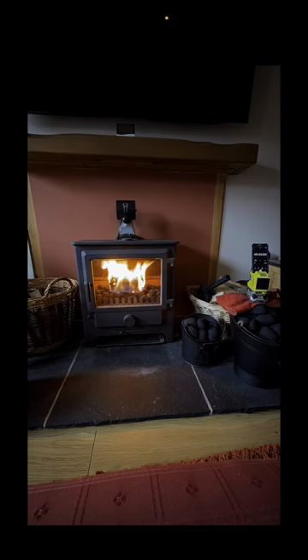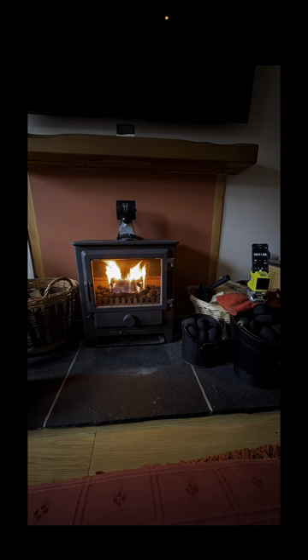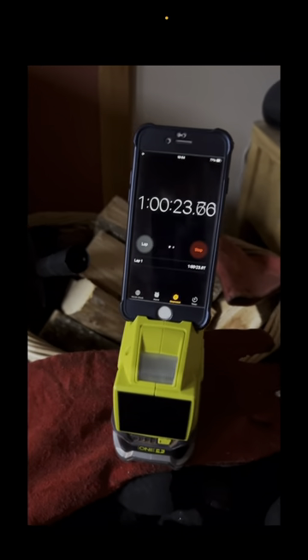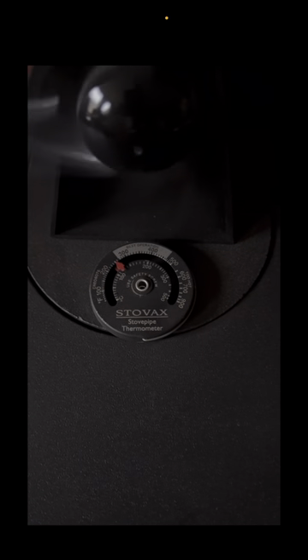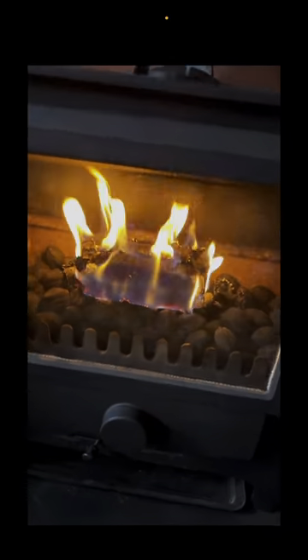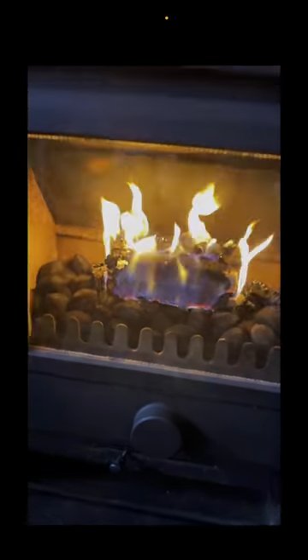It is quite hard to get it to catch fire. I've cut a little bit of this clip short because there's not much change. We'll stop at the hour mark and get another look. The stove fan actually came on at about 20 minutes — it kicks in when the stove hits about 60 degrees at the flue. So that's a good sign the stove is really warming up. You can see it's now over 100 degrees on the stove fan. I have a temperature gauge on the flue and also one on the side of the stove. It's a good flame still, sort of like an hour in.